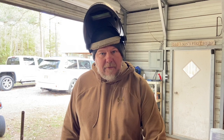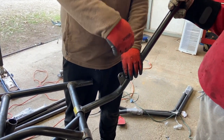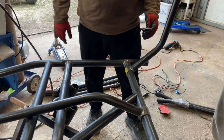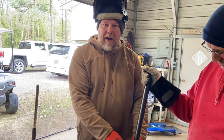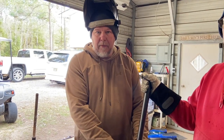The key is, when we put all this together with the seat in, we want that seatbelt to come up and around the waist to the driver. We don't want the seatbelt way out here — sometimes you see a long stretch before it gets to the driver. You want it as close as possible based on the recommendation of the seatbelt manufacturer.